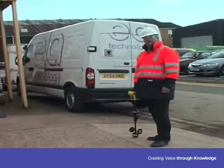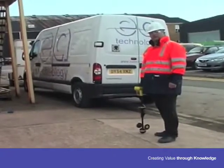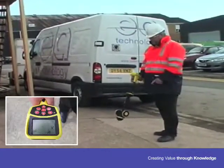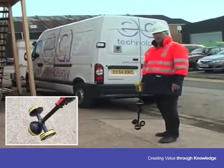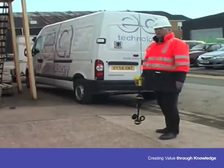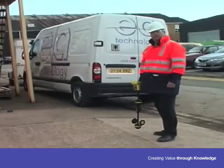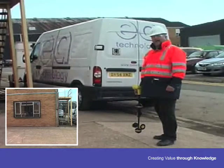With this, once we upload it onto our map, we'll be able to accurately pinpoint where the discharge activity site is. This will save our customer lots of time and effort trying to find his route length, and possibly a few wasted excavations. This is a brand new service that we want to introduce, and it completes the circle of our tests, so it gives our customer the best picture he can ask for.